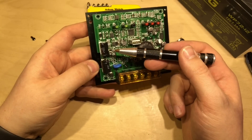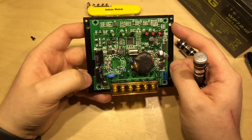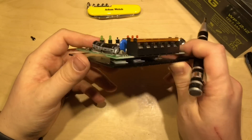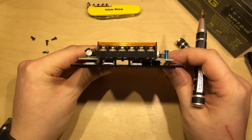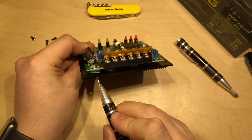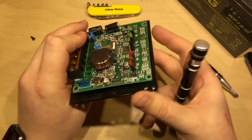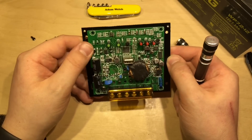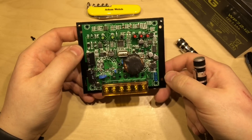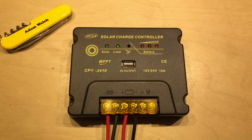There are two electrolytic capacitors on the input - 220 microfarads at 63 volts. I can't remember off the top of my head what the maximum solar input voltage is for this controller - we'll have to check the listing. The MOSFETs are on the back of the board, bolted to the heatsink as typical - three TO-220 packages at the bottom and another three at the top for various functions. It seems reasonably well made: it is fused, and there are low-value resistors for current sensing. I'm pretty impressed.